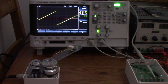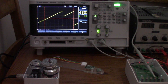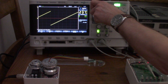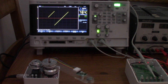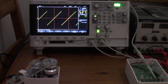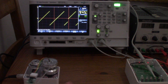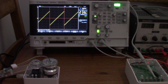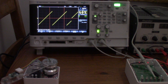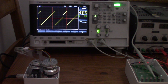The scope can hardly see the frequency here — it needs two edges in order to measure frequency. I'm going to close up the time base a bit, and now I'll write a table of offset versus frequency on the scope. We've got an offset set at 30, and remember this is on a one-to-one ratio. The frequency appears stable at 278 millihertz — it's varying slightly between 278 and 279, so I'll put down 278 millihertz at offset 30.